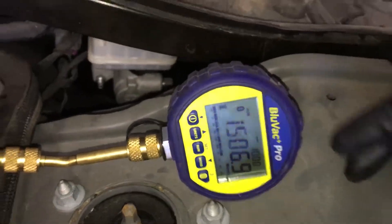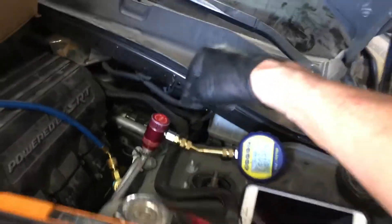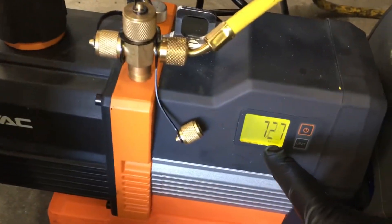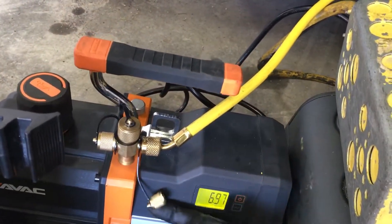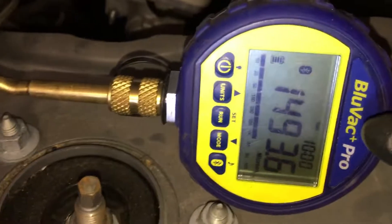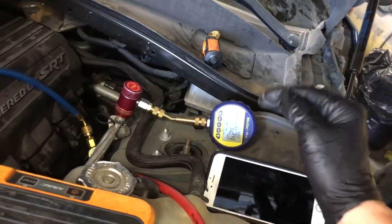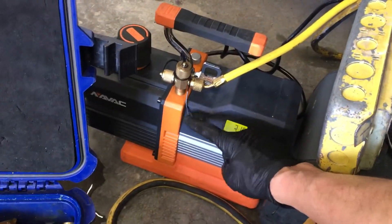I have 1500 microns right here — this is the micron gauge. Reading at this point, you're getting the true vacuum of the system. Now let's go all the way to the other side of the vacuum. I'm having roughly close to 10, 5 microns reading at the micron gauge right here. This is nowhere near the actual vacuum occurring inside the system. This is the actual vacuum — 1400 microns. You are nowhere even close to where you need to be, yet this side is well below 100 microns.